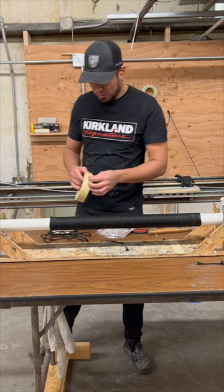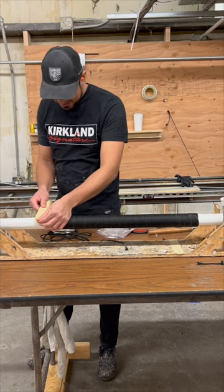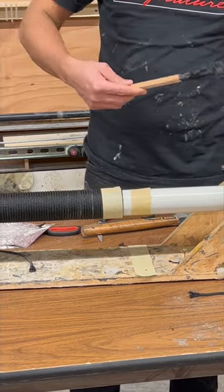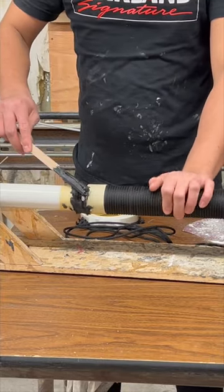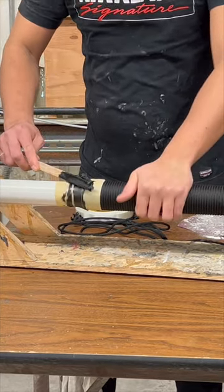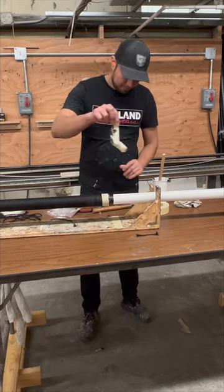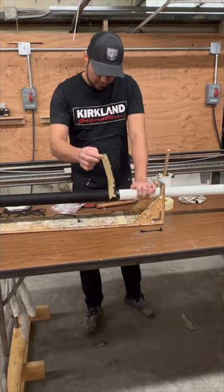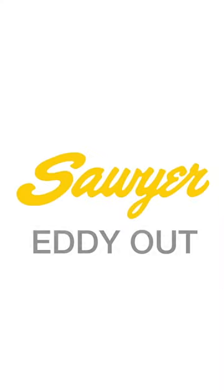Now we're going to move to the collar wrap section. This is an optional part — we do it on all of our oars that come out of the factory and we're just showing you if you wanted to do it at home. Dario is going to tape off the collar wrap on both the top and bottom part of the shaft and then use that same thickened epoxy to put on the base of the shaft as the collar wrap. We've thickened this with silica — you can use sawdust or any other type of fine grit at home just to thicken up that epoxy. It also does not need to be black; we put a special dye in there to match the rope wrap. If it's clear that's totally fine — we're just using it as a solid end point to our rope wrap and an extra secure finish. Dario is now removing the tape after we've applied the collar wrap on the top and bottom parts of the oars, and once you are done your oars are ready to go and get back out on the water. Thanks for watching folks.